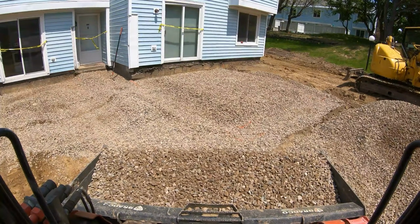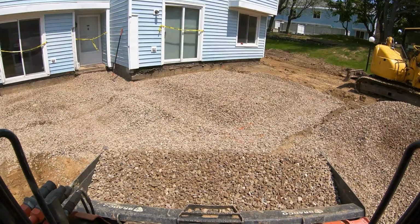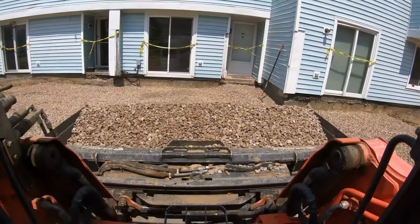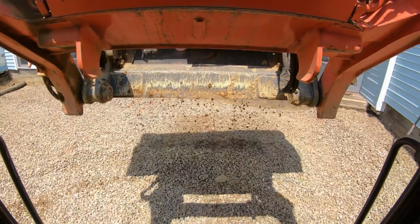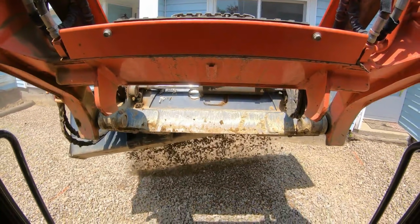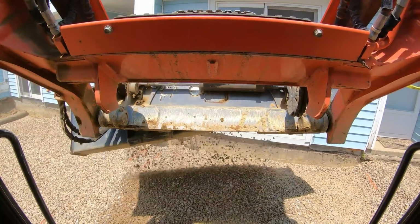Alright, as you see, I got that haunch that pad all roughed in, haunch all the way around, 12-inch haunch, and then it steps up 6 more inches with a 6-inch top. Not compacted yet. Going for the second one now. Got the layout. Throwing it in. A lot of obstacles. I got a manhole behind me, so I can't get square with it.